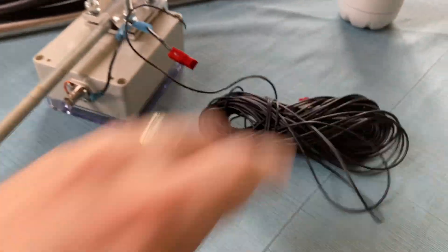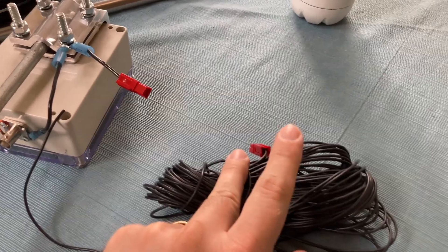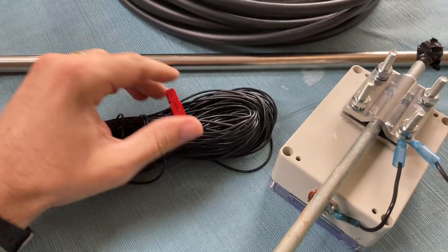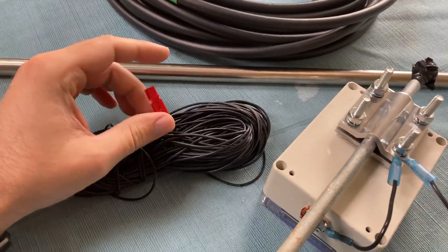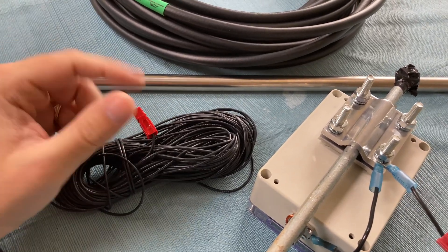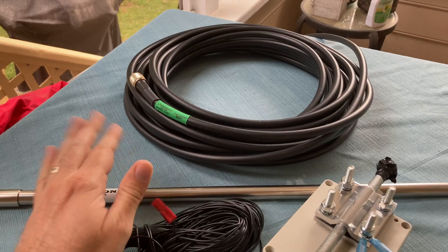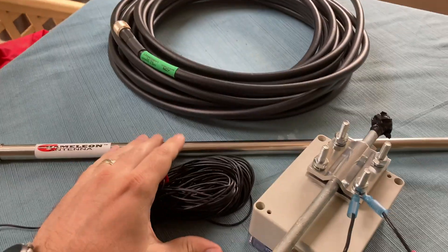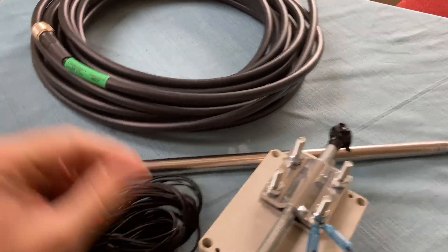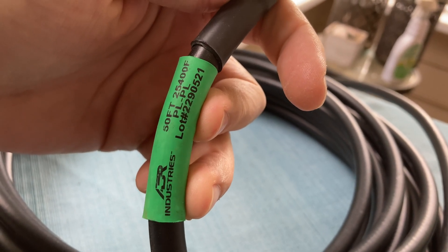I also have another little wire coming off to make a counterpoise - this is a 67-foot counterpoise wire made with 20 AWG silicone wire. Not sure how that's going to perform on high power, but we'll find out. For most summit activations I'm usually running low power. We've got our Chameleon SS17 spike - which I did not homebrew because it's a very nice piece of equipment - and I've got 50 feet of LMR 400.